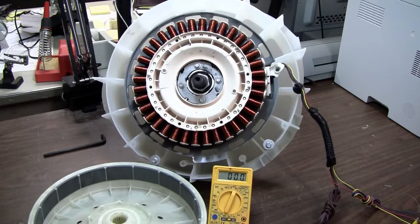What you see here is the motor stator and rotor salvaged from a typical direct-drive washing machine. This type of motor is becoming very common in many different brands of top and front load washing machines, and because it's so common you should be able to find these for free in any old junk washing machines in alleys, junk piles, or behind appliance delivery and installation companies. What is nice about this motor is that it's a permanent magnet three-phase high efficiency motor that can also serve as a high efficiency three-phase alternator with little or no modification.